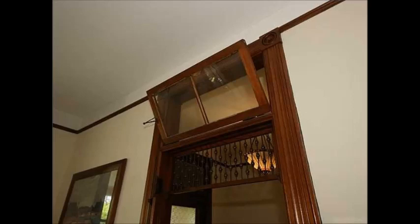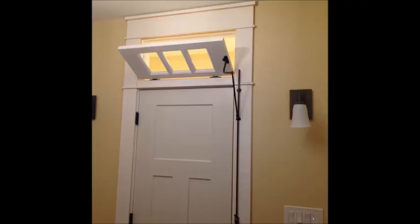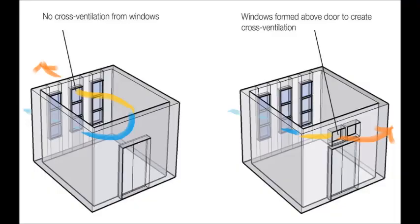The double hung windows were important because that allows you to open the lower section of a window on the cool side of the house, and then open a corresponding upper section of a window on the warm side to create that airflow that shoots through the house and takes the hot air out. Many of these houses also had transom windows above the doorways, which you might have seen in older homes and wondered what they're for. It's specifically so you can close the door to a room for privacy, keep a window open, and then have the transom window above the door open, so you're creating that airflow — sucking in through the window and going up through the transom window across the ceiling of the house.